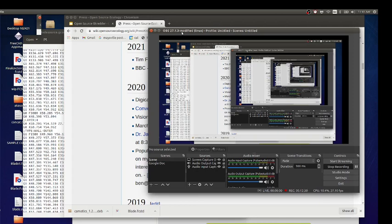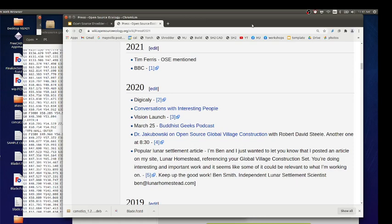Yep, so the only feedback. So how do you do that? There's details about the logic. If we want to look at the computer, this is all documented. But basically, when you have the drawer, you have to close it. There's a 6x12 hole on the brick press. You've got to close it off with what we call the soil loading drawer. It's on one cylinder, it just moves back and forth. But you have to align it so it closes the chamber right there, not there or there. You've got to close the chamber. It can't be partially open.